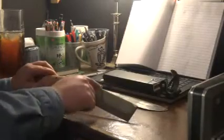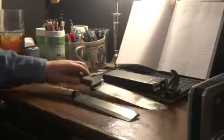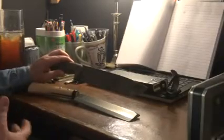There's a couple of things I'm rather interested in having a look at with this blade. Number one, is there any fragility or practical durability limitations because of the much more acute edge angle? Secondly, is there going to be any wedging issues because there's no actual grind here? When you have a full flat ground blade like this, the only wood that it tends to get bound up in is wood that anything gets bound up in.